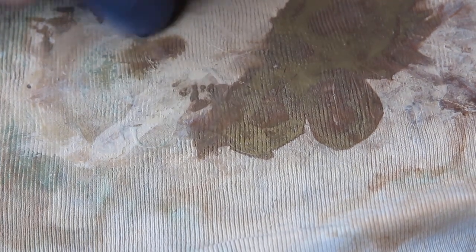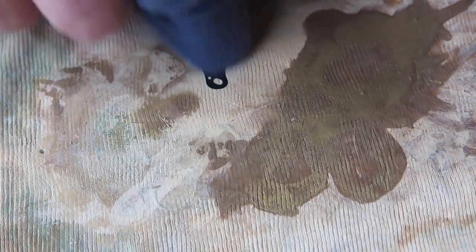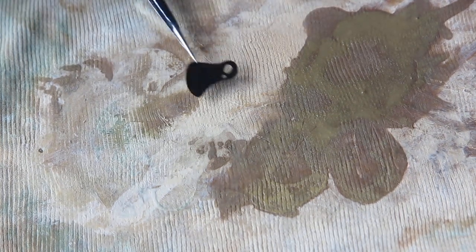All of these blades now, having been polished with Brasso, need to be cleaned with naphtha to remove all traces of the polish. And I strongly suspect that the polish, that blade just took off into the distance. Let me see, it's over there. I strongly suspect that the Brasso leaves a protective wax or similar surface on the metal, and of course I don't want anything on the metal. I want them just nice and clean.